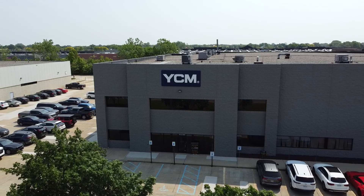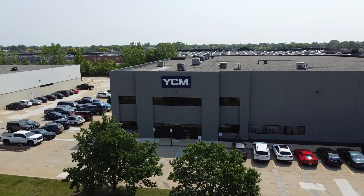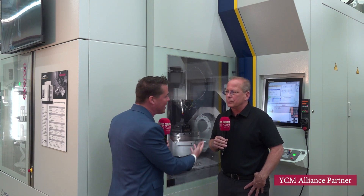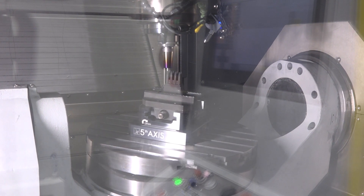Doing more, and knowing that you're an expert in so many different fields. I look at 5-axis as one of the technology jumps. When we incorporate 5-axis into a shop for the first time, we see one 5-axis machine taking out about four vertical machines in capability — especially with the right work and the number of setups. When you add automation, that ratio goes up to about 7 to 8 to 1. The throughput you could experience on a shop floor with 5-axis and picking up those additional operations with automation — it's game-changing.